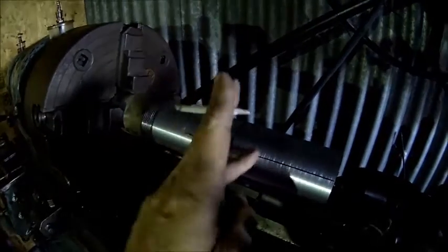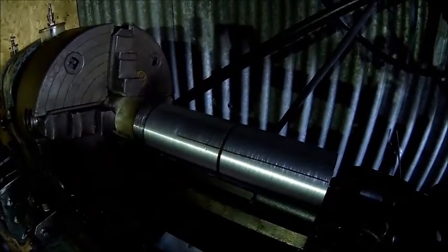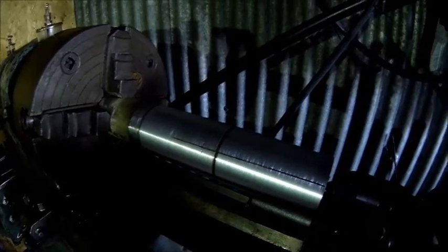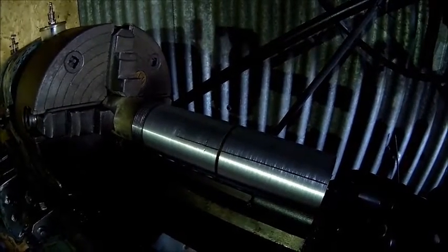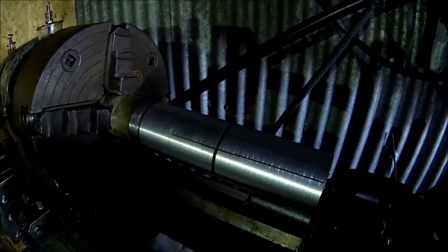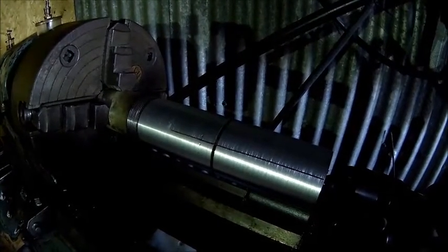You can see that cut in the shaft here was producing an interrupted cut. The surface finish is not the super best one, but that's not the machine, that's actually the tool. And I think my feed rate was a bit high. So let's measure that and we'll see. Well, what we can see is in this area we are 1 or 2 hundredths thicker than here.